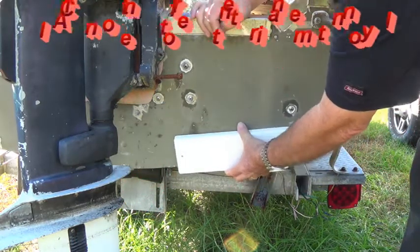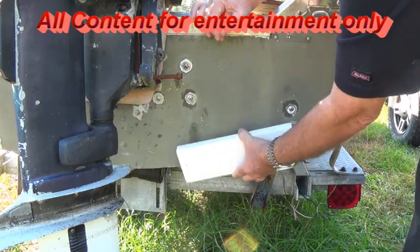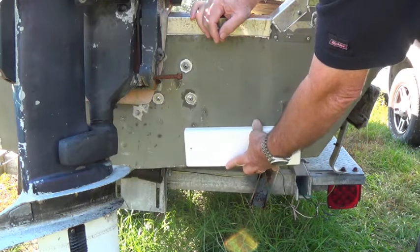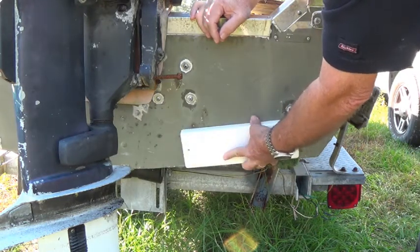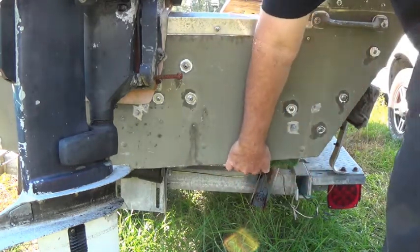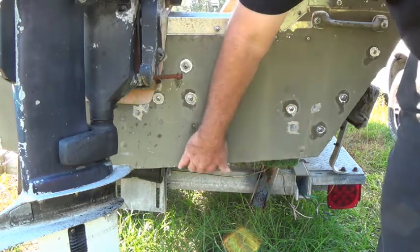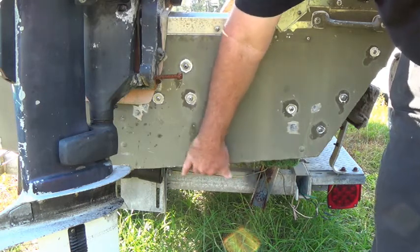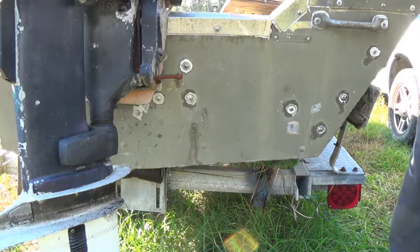Okay, I'm thinking I want to install that right about here. I want to stay to this side. I've got that one rivet I'm going to have to make a notch in the back for, so I don't wobble. And it says keep it up 1/4 of an inch. Between the ribs here, I'm going to mark them out so I get a nice trailing edge and everything for my transducer, because I want to actually put more than one on here.